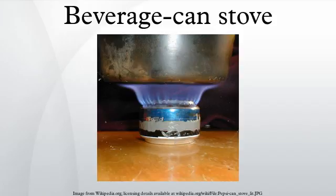The stove is made from two aluminum can bottoms. An inner wall is cut and rolled from the can material. A ring of holes is pierced into the top with a pin. Parts are glued with high temperature epoxy, or sealed with thermal foil tape, although this is not strictly necessary. Total height is less than two inches, though dimensions may be increased to hold more fuel or decreased to take up even less space. The choice of aluminum has several advantages: lightweight, low cost, and good thermal conductivity to aid vaporization of fuel.